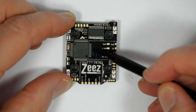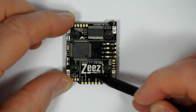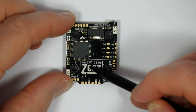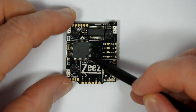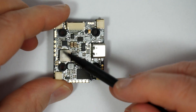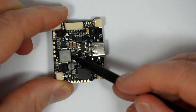These are the two locations where you can mount the receiver and a VTX. You can power this off anything up to 8S, and there's also an onboard 5V 3A BEC for powering cameras, VTX, LEDs and so on. That's over here. And this is protected from over current, over temperature and short circuit.